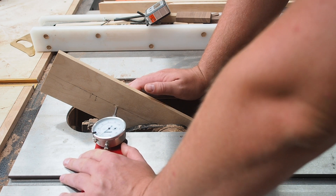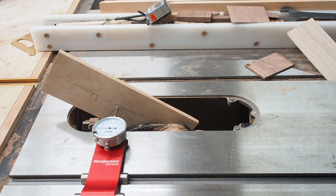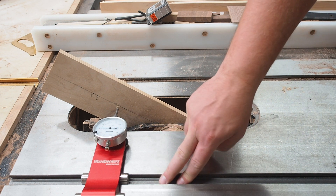Now I'm going to rotate this to the back, keeping contact with the board, then go to the same position. This is telling me that I have three thousandths of an inch of deflection from my miter gauge to my blade — so I'm three thousandths of an inch out of square. You have to decide: are you going to fuss over trying to take out three thousandths of an inch? My answer is I don't think that's causing any issue in my joinery, and three thousandths can easily be dealt with by a plane and a shooting board.